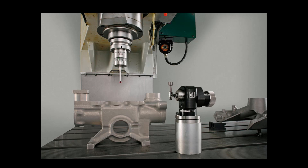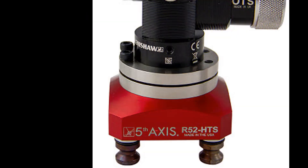Someone may ask: how often should I calibrate these? The spindle probe I like to check at least once a month, although calibration is not necessary unless it's been bumped or removed from the machine. The tool setter I'll check once a month as well, but the only time you really need to recalibrate it is if you've pulled it out of the machine — unless you have one of these fancy little doohickeys from Fifth Axis, a quick release mount for the optical tool setter from Renishaw. It repeats like a dream, so you can pull your tool setter out and replace it without having to do a recalibration.